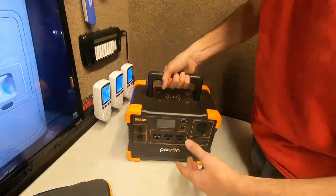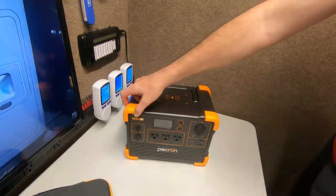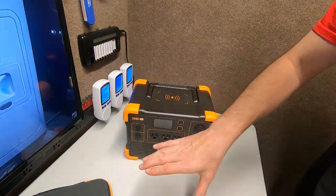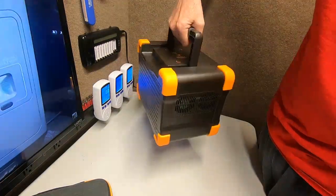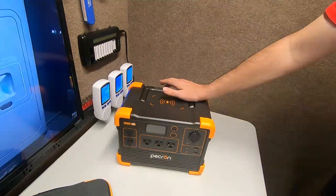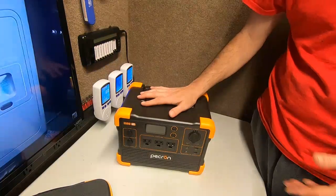She's falling in love with this one, so maybe I can get rid of the Mylon — maybe I'll have a giveaway someday. This is basically a 614 watt hour, 1200 watt rated AC box — it can put out 1200 watts. Anytime you have an inverter bigger than the battery, efficiency will drop a little, but a little box like this can power 1200 watts — that's almost everything you'd need for camping. The air fryer might be a little too much at 1200 watts.